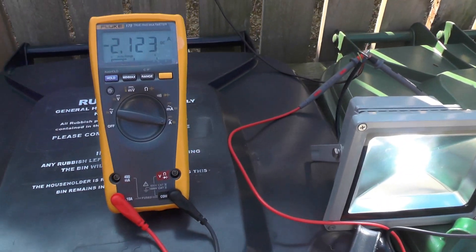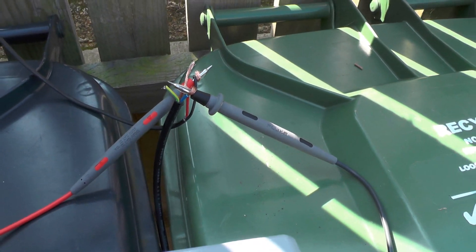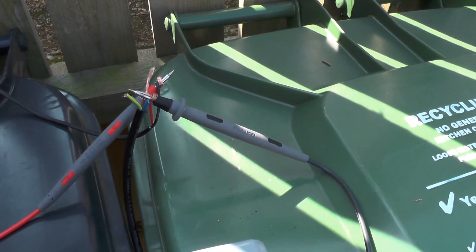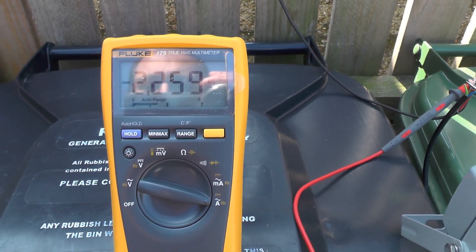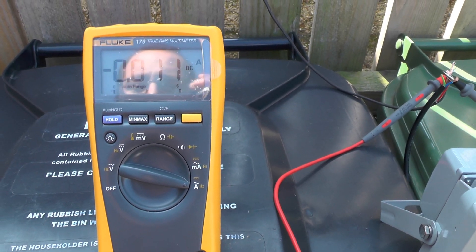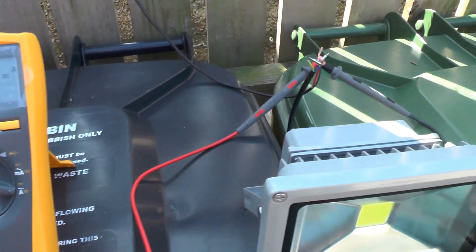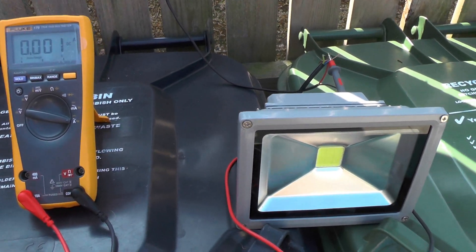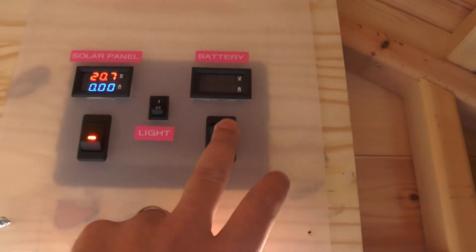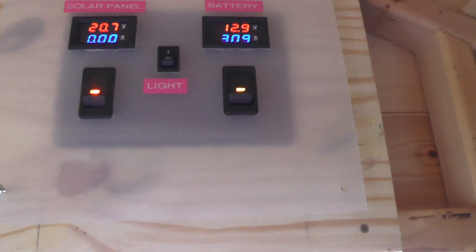Okay, I'm back and as you can see I'm now on the neutral side. I may have got the wires slightly the wrong way around — 2.25 amps flowing back through the neutral. I'll reverse it... okay, nothing coming out now, so let me switch those wires around. I've reverted the cables — nothing there because I haven't switched on the battery yet. Let's switch it on, and immediately the light is on and it's drawing 3 amps.